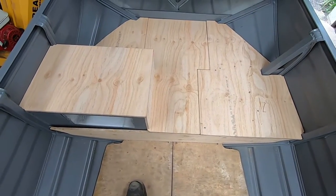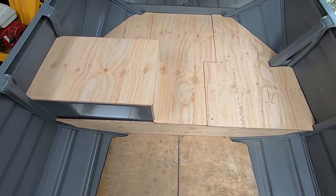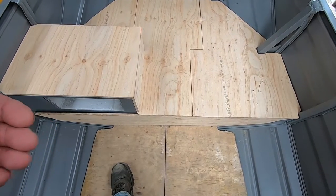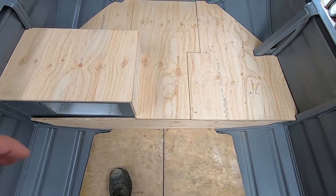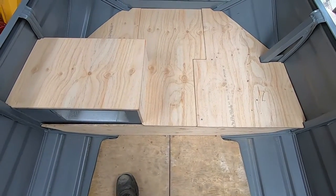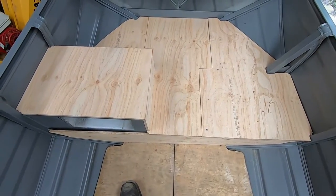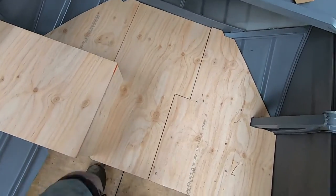So that's all the timber work done in the front deck. So what we'll do is pre-drill everything. That means, because when you paint the boards, obviously that seals it. Then if you put them on and then drill them later, you've just basically got fresh wood you've opened up to water getting into. So I'll drill them all out. Then when you paint, some of the paint runs down the hole you've just drilled, and you can find them easily enough later anyway.